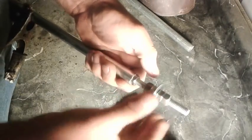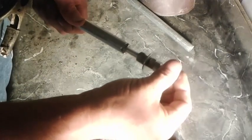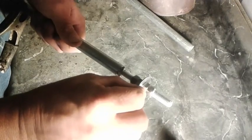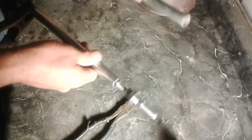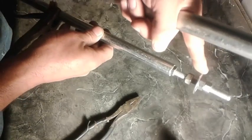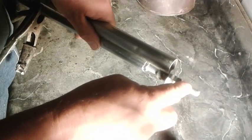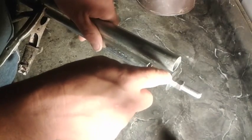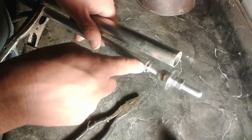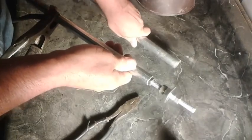You have this nut that's wedged in here, and this washer that is double-nutted. As you turn the all-thread rod, this is going to move this way, which means the washer is going to move that way. After you get this stuff welded together, you take this pipe and put it over this way and weld the pipe to this washer. All this is inside, and when you hook a drill up here and turn it, it spins freely through the washer and uses the threads in the nut to push this out of that pipe. That's the way my linear actuators work.